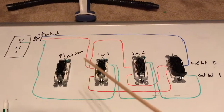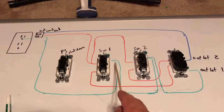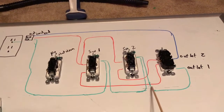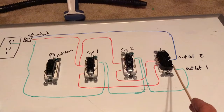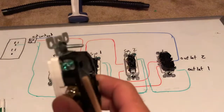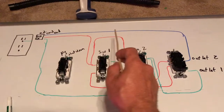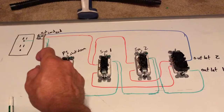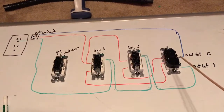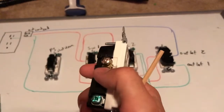Here's how we're going to wire this — it's very simple wiring. I've got my extension cord end here. We're going to take the ground, go to our first switch onto the ground, come back out with a wire, go across to the next switch, come out with another wire, and go to the ground on each one of the switches and to the outlet. That green bolt on each switch and outlet is the ground. The common — I'm using blue for that — is the bigger spade on the outlet, and it's going to go over to the common side of the outlet.